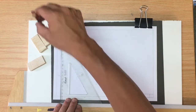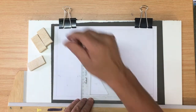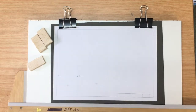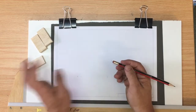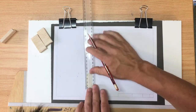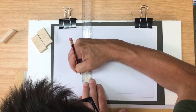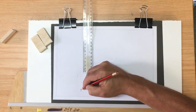By putting those simple marks on and just measuring across, I can do all of my verticals. For all of the verticals, I have to lock my T-square in to the left-hand side of the board and lightly mark those lines out — every one of them perfectly vertical and accurate, set up with the T-square and set square which measures a 90 degree angle.